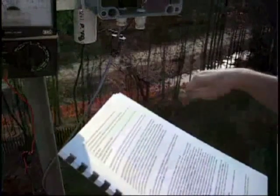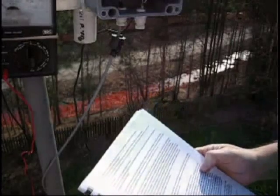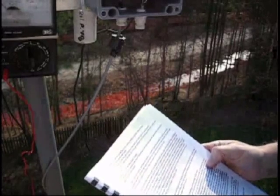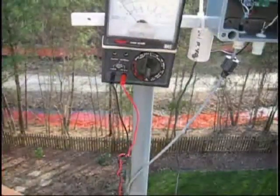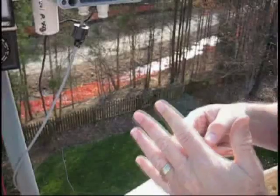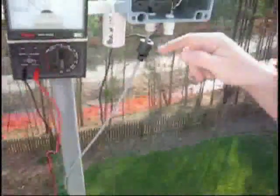Bad connections are often the problem. Just wrapping wire around the rod or wrapping the wire around a screwdriver and throwing it in the ground — that's not going to work. You need to have a copper-clad ground rod in the ground, soldered or tightly clamped. The wire needs to be properly installed, all secured, straight, no coils. Someone sent me a picture one time and they had run the ground wire, but 90% of the ground wire was on a spool laying right next to it — they didn't want to cut it in case they needed it later. Not going to work. It's got to be a straight shot from the binding post right to the ground rod: no loops, curves, or detours.